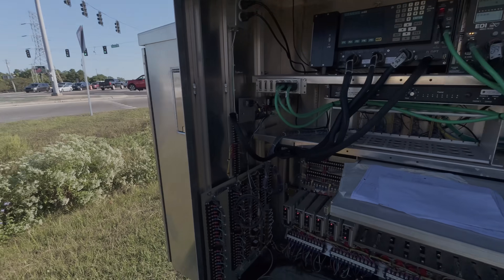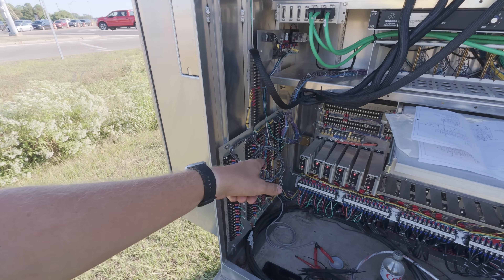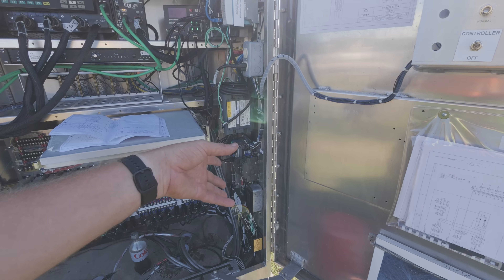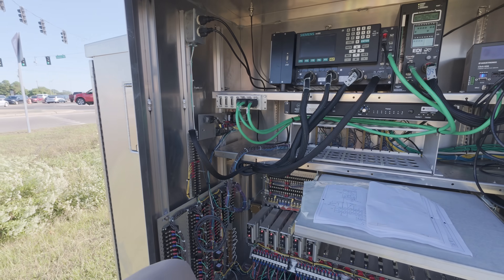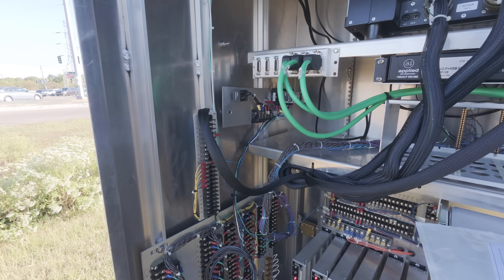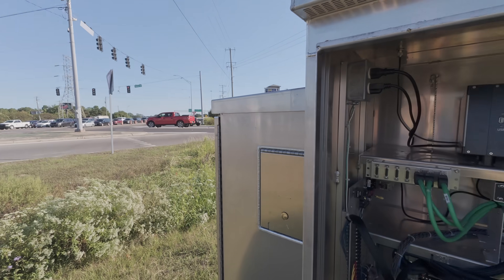Probably the laziest dress-up I've ever done, but in fairness, I'm going to talk to my vendor rep and just make sure it's not an issue putting it on that terminal. Maybe there's a reason it needs to trip this specific breaker — which is most of the time why they would specify where it lands. But for right now, it's wired up and ready to go. We just got to get our two-conductor cable pulled for the hut, and then get the other one pulled to the blank-out sign.